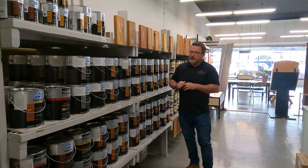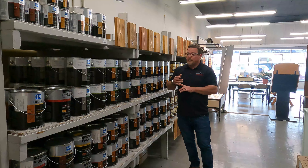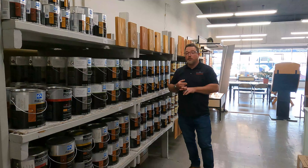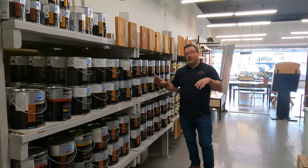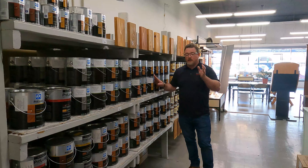This product requires 24 hours dry time. You don't want to apply it where there might be rain or moisture setting in, so there's a limited window here in the Northwest where you can apply it. It is oil-based and cleans up with mineral spirits or lacquer thinner.